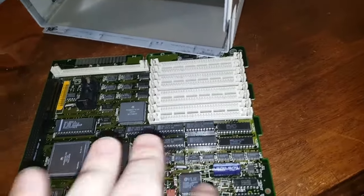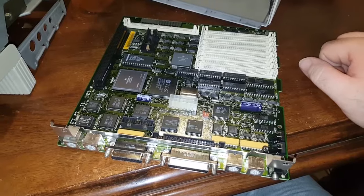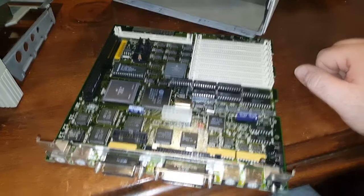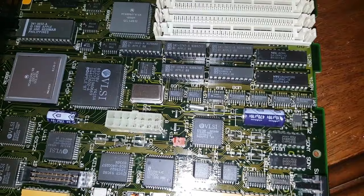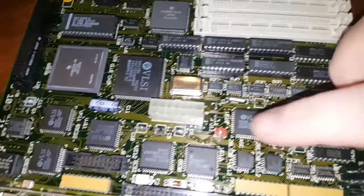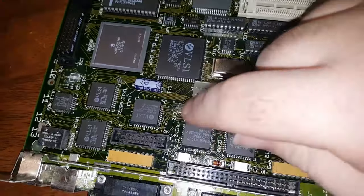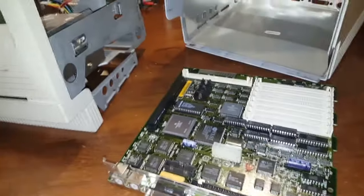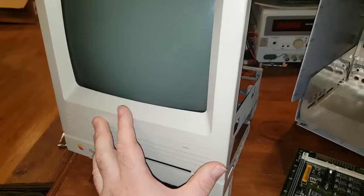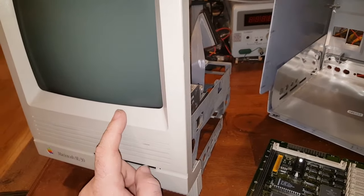I do the dishwasher wash just to get the capacitor goo out of the board. As soon as the washing was done I had the oven ready at about 185°F — just under the boiling point of water — to let the board dry out for about 15–20 minutes. The bad capacitors literally just fell off the board; I didn't even have to do any desoldering. But I'll have to clean up the corrosion because there's a possibility that circuit traces are broken. The reason I want to work on this logic board is because even though I've already got a working SE30, this one has the least capacitor damage.